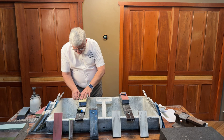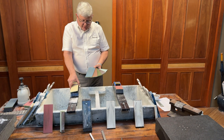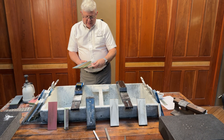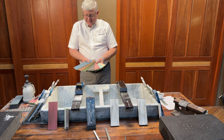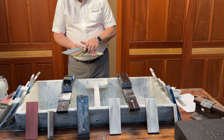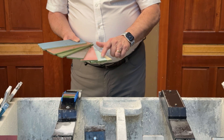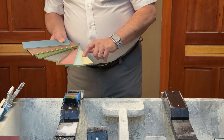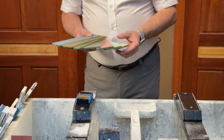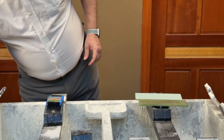I have the diamond resin plates — the full-size plates — in seven micron sizes. I can put them all here in order. Now you can see all seven abrasive sizes, and they're color coded. The coarsest is the 200 micron, then half of that is the 100, half of that is the 50, half of that is the 25, and then we go down to the 10 micron light blue, the 3 micron, and the sort of yellow 1 micron. That's the full line I manufacture and offer.